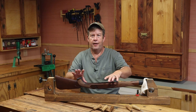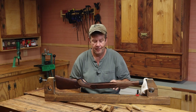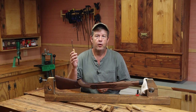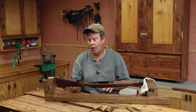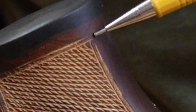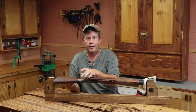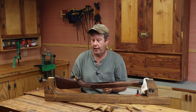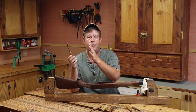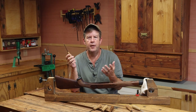All right. Once we've got the lines finished, and we've done everything from every direction, we're done with the lines, then we go over it with the border tool, and then that's going to clean up our overruns. And then finally, in the corners where the borders meet, with the border tool, we've got two options. We can stop short and then use our cutters and knife just to clean up the corners, because if we want a clearly defined border all the way around with no intersections, we've got to stop short just because of the nature of the tool.